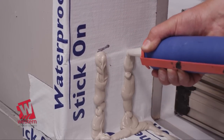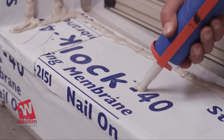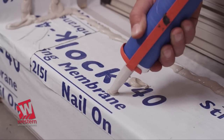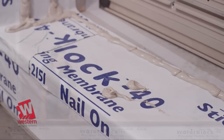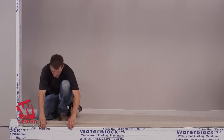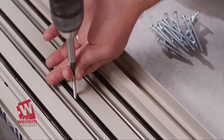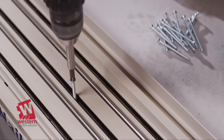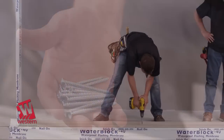If the floor is wood with flashing or waterproofing, apply a generous amount of the appropriate sealant at each mark where the installation screws will penetrate the flashing. Using the marks on the floor, set the threshold assembly back in place. Shim as required and proceed with anchoring. Use number 10, 2½-inch flathead screws in the weatherstrip channels.